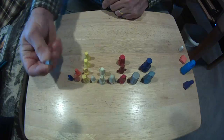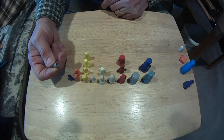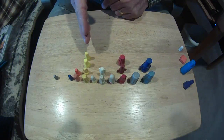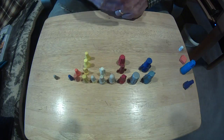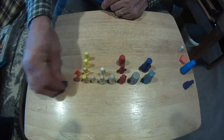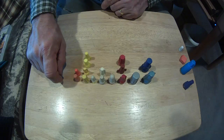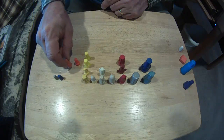You get the small ones, the little gray ones are like ballast wire, thermostat wire. And you have to go to the box for each one of these, and it'll give you a chart on how many and what size wires or combinations thereof that you can put together inside one of these wire nuts. The blue one, again, thermostat wire, ballast wire. Here you got the orange ones, two different orange ones, two different manufacturers.